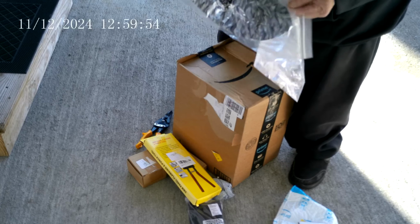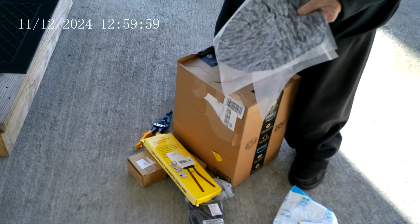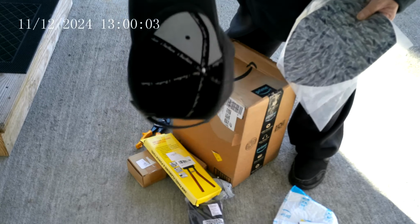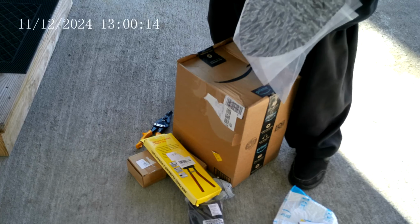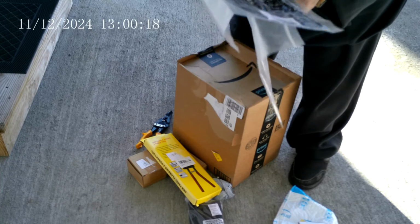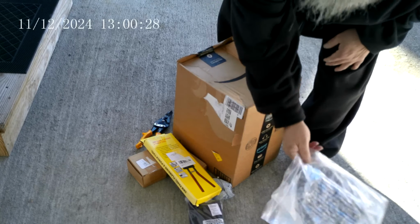This is one of those welding caps. You don't want to wear a hat like mine with my channel logo on it while you're welding. If a spark was to hit on this, it would ember. It would burn. This is a flame retardant material that will not burn. It will protect the top of your head. Even if you have a helmet on, you want to wear something like that too, because it helps to absorb the sweat.